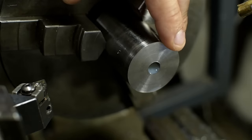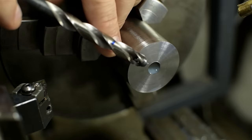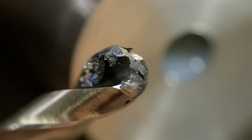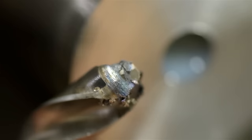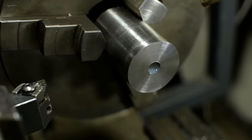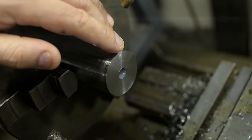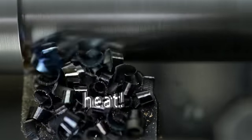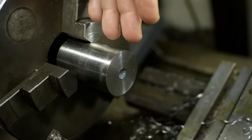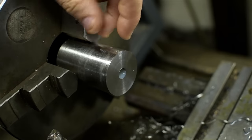It's all fun and games in the edited video, but drilling that pilot hole was brutal. This piece of titanium just ate my drill bit alive — the business end is just melted and worn away. I think when I got too deep, I just didn't have the coolant pressure to get in there, cool the tip of the tool, and help flush those chips out. Despite the coolant I did have, everything got smoking hot. Most metals you probably run into in a home shop lose most of their heat in the chips. This zany titanium is just the opposite — the chips are coming out cool, and all the heat is staying in the work piece, consequently cooking my tools.